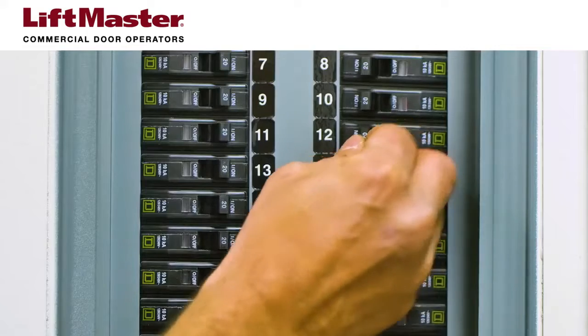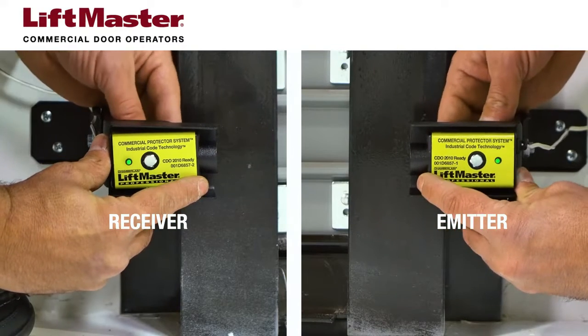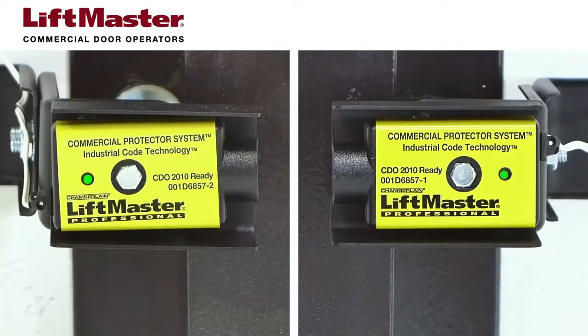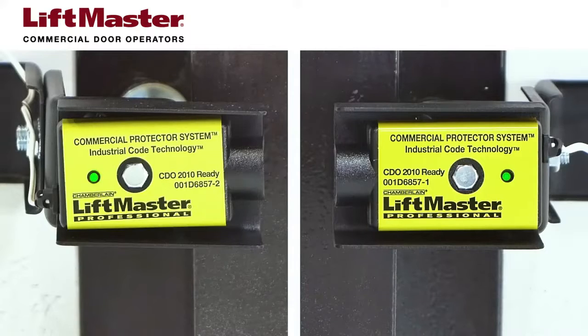You'll need to restore power to the operator to complete the next steps. Align the photoelectric sensors by loosening the nuts and adjusting the positions of the sensors until both the receiver and emitter display solid green LEDs. For the CPSU photoelectric sensors, the sensor LEDs glow solid green when powered and aligned properly. If the sensors are misaligned or if the beam is blocked, the sensor LEDs will blink green.